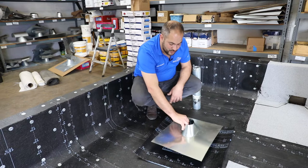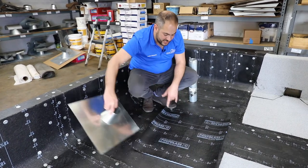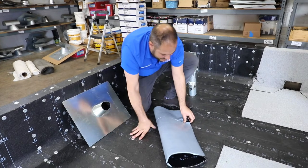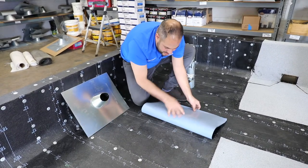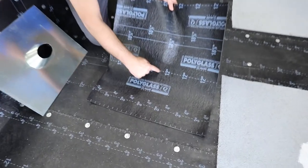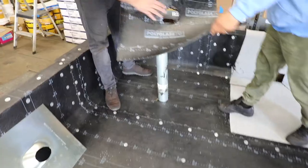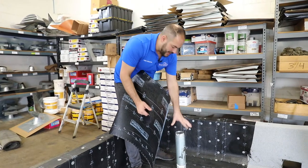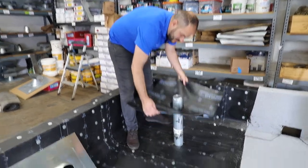The size of our target smooth is determined by the size of our flashing — we want a minimum of four inches around each side. We've got this piece cut out already and we're just going to cut a hole in the center to fit it over the pipe. An easy trick to find the center of any square piece is to fold it diagonally, make a crease, then fold it in the opposite direction and make another crease. This cross-section points out the middle of our patch. The cut doesn't need to be perfect — about a half inch to an inch away from the pipe is fine. If the pipe is a hot pipe you want to keep it further away, but generally a half inch to inch gap is good.